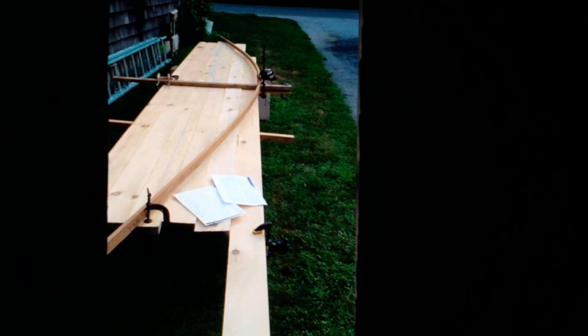It's a big dory. The bottom is 16 feet. I made it up out of fairly narrow bottom board stock so that it wouldn't move too much, because it's such a heavy bottom and I knew I was going to want to fiberglass it. Those are two-by stock cut down, planed down to one and a quarter inch thick — that's pretty heavy for bottom boards.